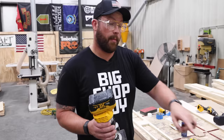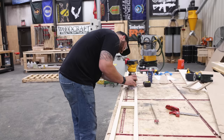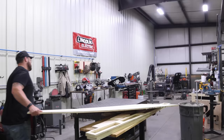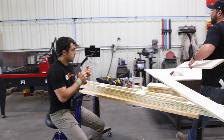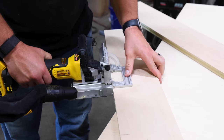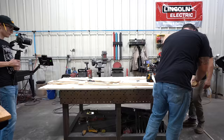I've got a templating bit with a bearing down here. Everything's held on with the blue tape trick. This new cordless router from DeWalt has a stop clutch so it immediately spins down — super nice. I'm going to route this out and then Jordan's going to finish the rest on the CNC. We're going to start assembling the base, and Jordan's going to cut all the dog holes on the CNC because ain't nobody got time for that. If you're going to build this, we'll have two different layouts — one a little more intricate for our uses — and you can definitely do them by hand.